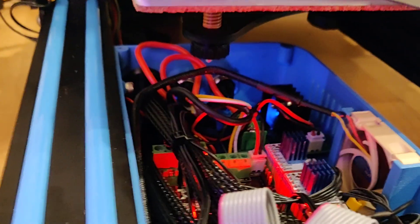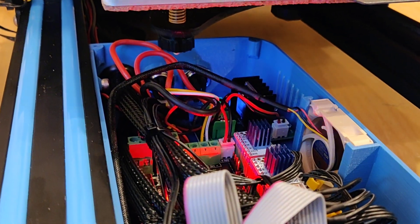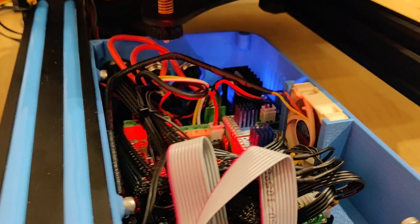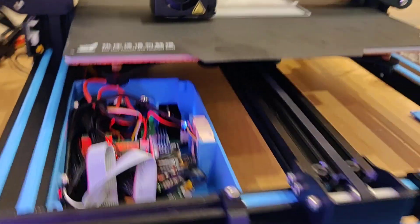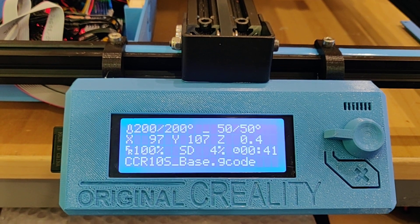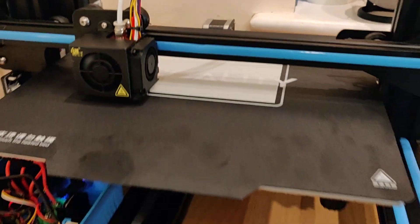The original Creality MOSFET is in there and works fine on 24 volts. I googled the chip and it's rated to about 60 volts, so it's sat there quite happily — not warm at all. I'm printing at 200 degrees on the hotend and 50 degrees on the bed at the moment.